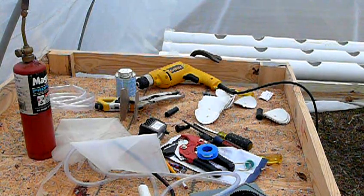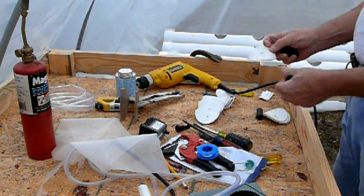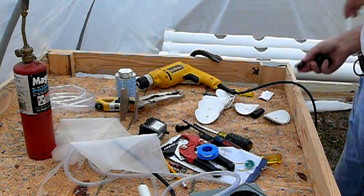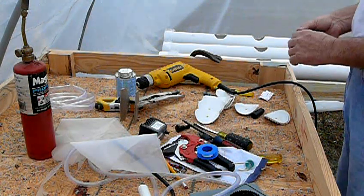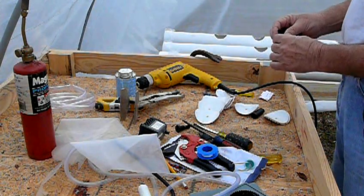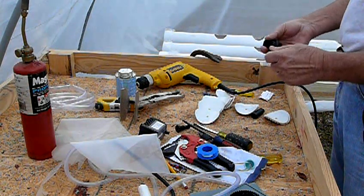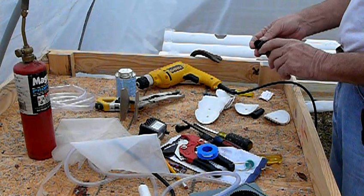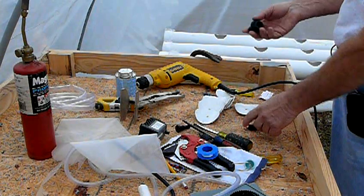One of the problems I had was the center tube because it was right below the pump. I kept elevating this tube, trying to shim it up. I was using these little leftover pieces, which come in quite handy as shims underneath each individual tube. But the center tube would overflow, basically because the pump was spraying directly up through that header, so I took a little piece of plastic tubing, rolled it up, and stuffed it down into the bushing that's in that center tube — actually in all of the tubes — flush, and it afforded a little bit of restriction.